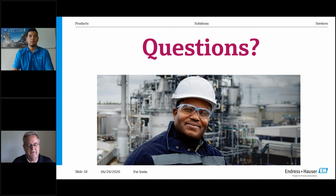And just please advise though, if it is for the safety system, because we'll ask you a few questions. Like, do you want red caps on it from a visual identifier in the plant? It's a real common request from customers. And then the other is just make sure you know it. So we do make sure it does have the TUV label and the certificate that shows up with it. So your safety officer has that on record.